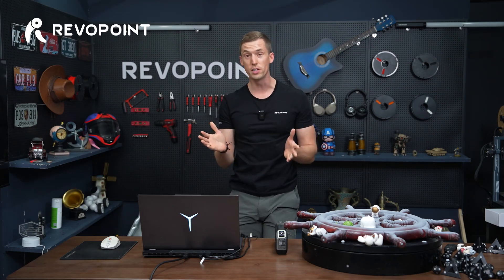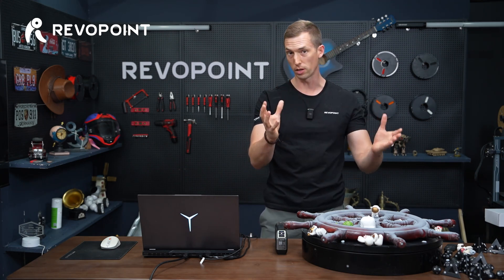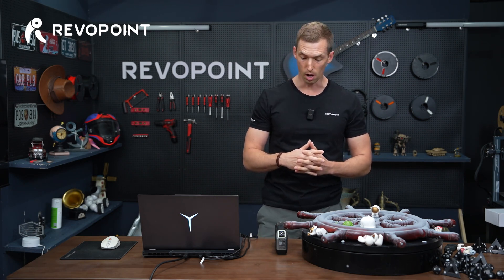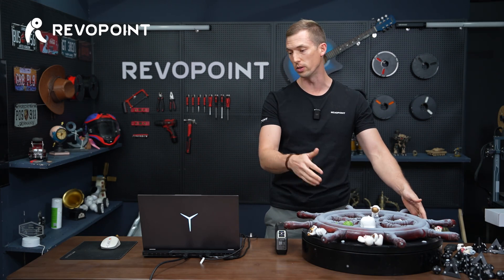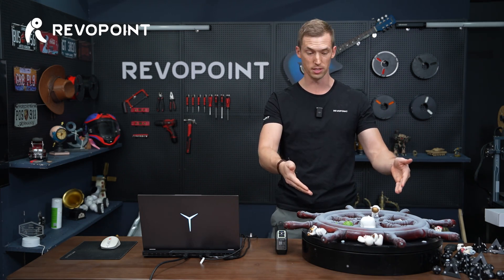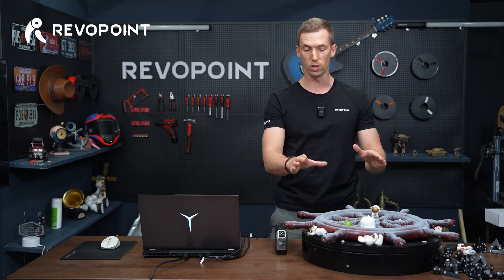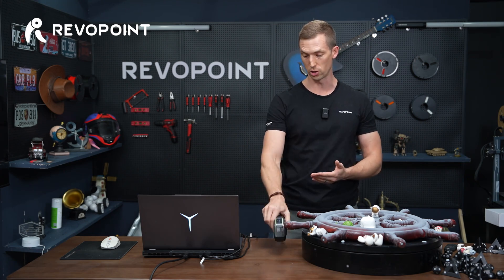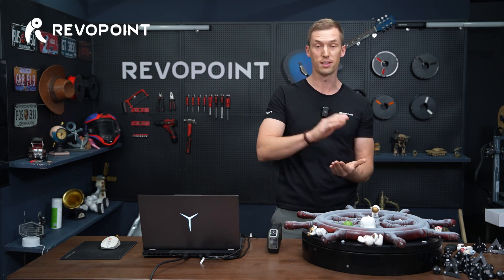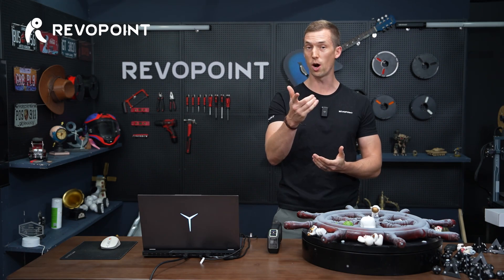Let's briefly go over what we covered in this video using Metro X. We started with talking about the accelerated GPU, and we saw throughout the video how much easier it was to use Metro X because of that — capturing point clouds better, smoother, no lagging. Also, with the large turntable now hooked up to the software in auto turntable mode, it made it really nice for scanning a larger item like this steering wheel. Because of that we were able to use the full structured light and get the surface scanned really well, then flip it over and use the laser function — 14 cross lines in Metro X — to get the other side, and then we merged those two together. Hope you enjoyed watching — we'll see you next time.